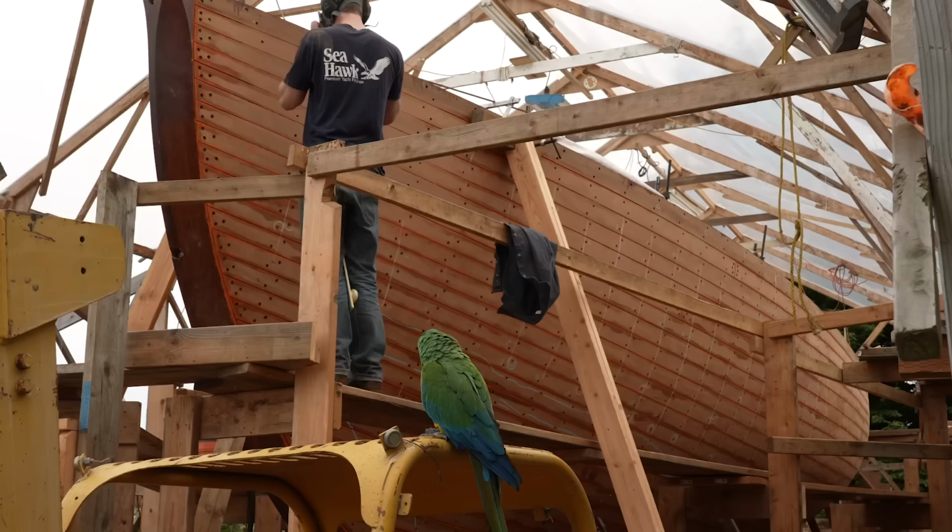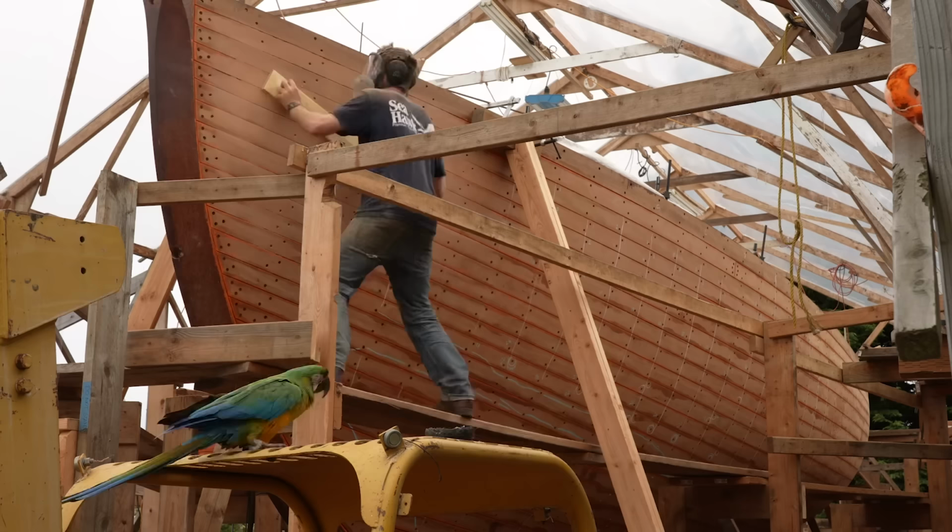Now, a longboard is essentially a long board. It's a sanding backing pad, which has just the right amount of flex in it that it can bend around the curves of a boat, but it's not so flexible that it's going to follow small indentations in the hull. Because of that, it automatically sands away the high spots and leaves the low spots until everything is even and fair. They're notoriously painful to use, hence their nickname, the torture board.